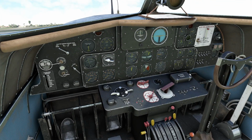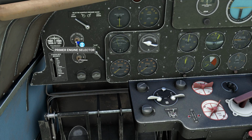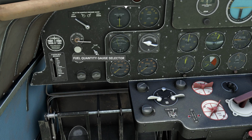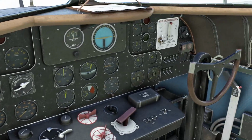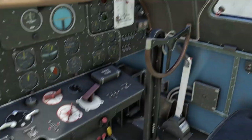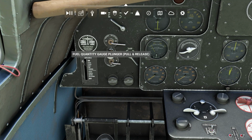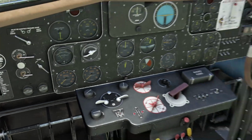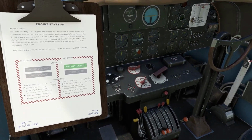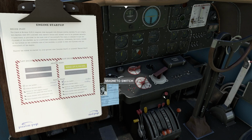And we're basically gonna do the same thing for the right engine. So, magneto, Lunkenheimer primer, so off, right engine. We're gonna move this over. Not this, we're gonna move this over all the way to the right so we can monitor the temperature. Here we have the oil temperature on the left engine. It's rising. And that's good. That's really good for us. It should rise. So, holding this, pulling, 1, 2, 3, 4. Picking up the thingy. Pumping. We've got pressure, wind up flywheel. And now we have to maintain the pressure between 3 and 5.